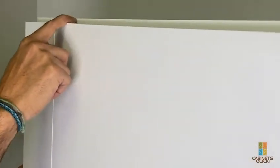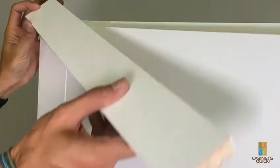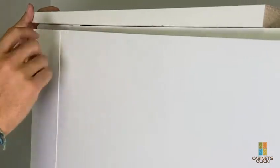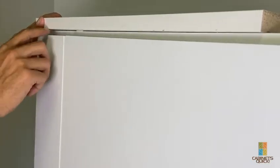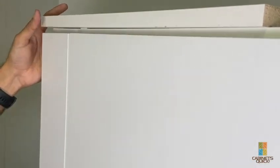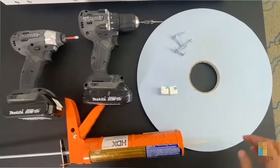That's the best way to install it — everything's aligned and plain. The thing about the fillers is we keep them level to the top reveal. The reason we do that is when you put a countertop on, the countertop line carries without the countertop installer having to do anything. On a stone top it will drop a little and tighten up the reveal, but we use a 3/8 so your stone installer won't have any problems putting the finished top on.